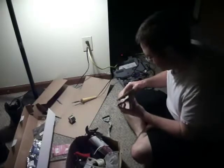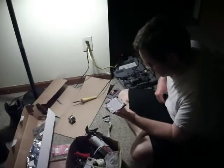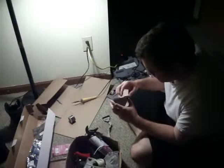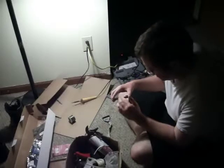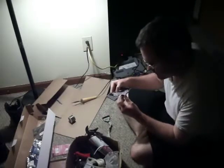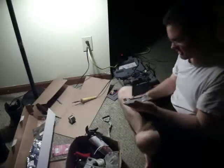This I cut out, just an update on this. From the last video you may have seen, I basically just glued these down and got it ready, and it fits the Raspberry Pi just fine. Slightly loose, because I intend to paint it, and the paint will take up some space. Here I cut out a notch for the USB, maybe a little bit too big. Haven't notched out anything for Ethernet yet, because I haven't used that. Notched out for the power, for the SD card, and for the HDMI, as always, I do these a little bit too big.